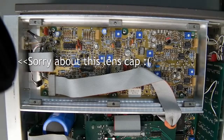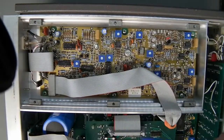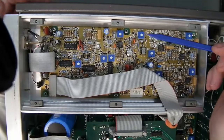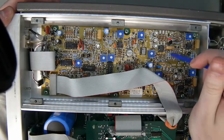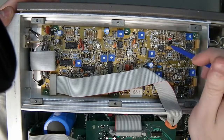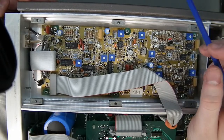So this is board A2, according to the manual. At the back here we have a 20-pin connector, and another 20-pin connector coming in from the side. Lots of trimmer caps here — I don't want to touch them if I can help it. I believe these are all military-grade capacitors. They've got a solid plastic coating — I'm not sure what the plastic is, but it's solid. I'll give you a side shot of them in a moment.